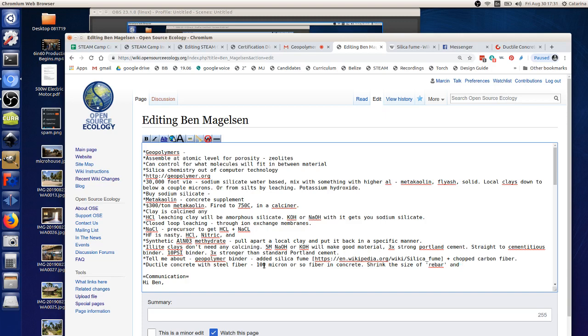The new material science uses smaller particles with more surface area interaction — that gives extra strength and minimizes failure. The key is minimizing failure within the composite material. If your largest aggregate is 100 microns versus a standard concrete with a three-quarter inch rock, you're talking maybe 10,000 to 100,000 times smaller, so the initial failure size is that much smaller to begin with.